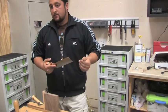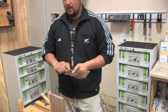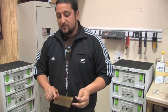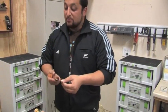If you're off at the beginning you may have an angle, but you're never really going to curve very much, because the set is so thin. Some guys will take the set completely out of their saw — I don't do that, because the set is there to help remove the waste, the sawdust. So I don't take it completely out.